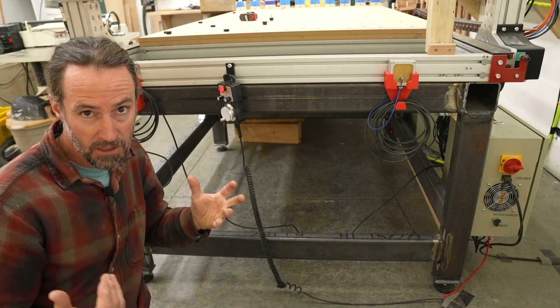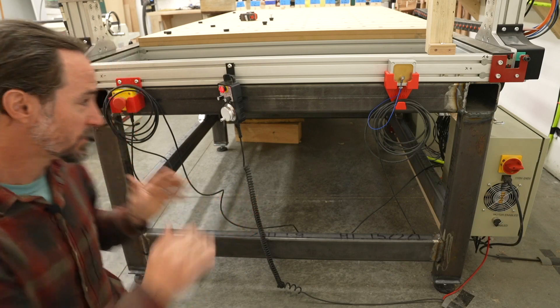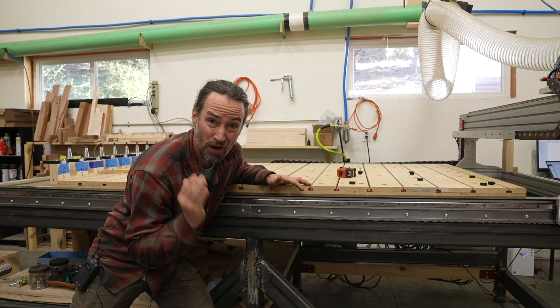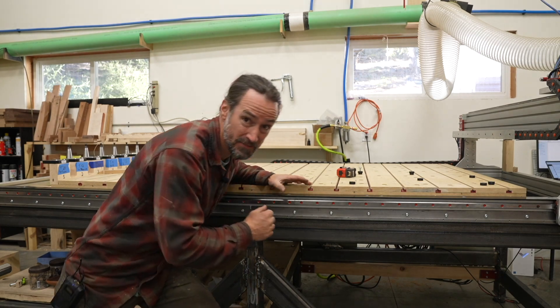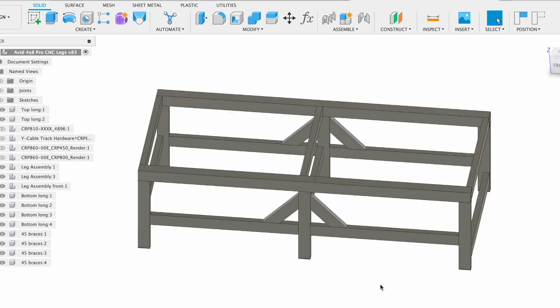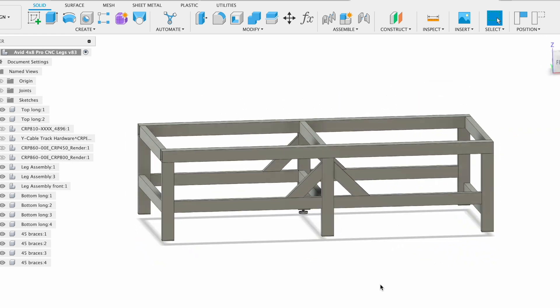When I use the CNC I don't get a lot of flex on the x-axis, probably due to the box design that helps stabilize it, but I do get a lot of flex on the longer y-axis. Someone suggested that I should add a longitudinal piece on the bottom along with some supports running down to it to help prevent racking.